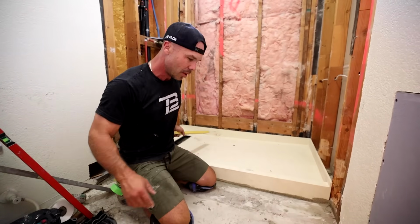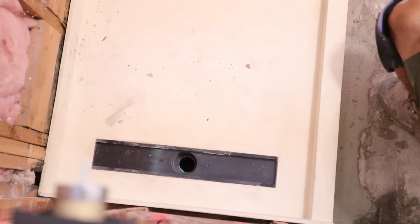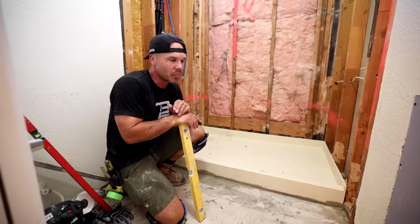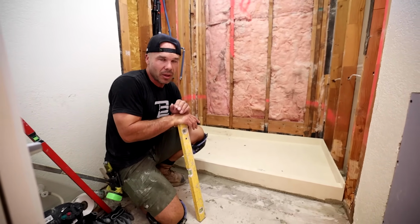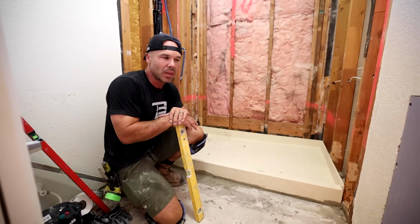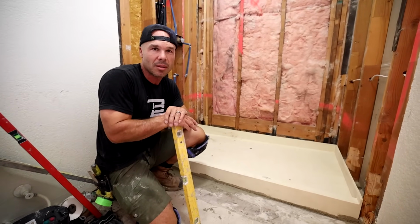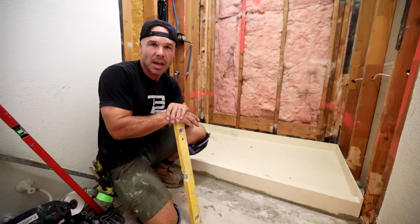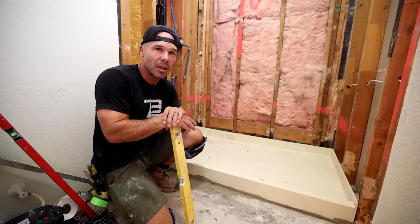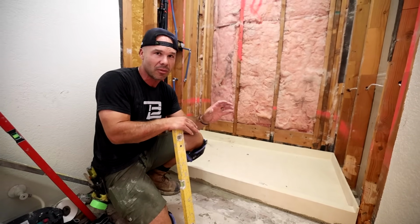You've also seen in a lot of my videos I've talked about the linear drain dilemma that we have. We've done a lot of Schluter Kerdi line drains, and with all the rash of failures that are happening with the fleece delaminating from the stainless steel, I haven't been able to do a line drain system confidently. And I've had customers ask me about them. I say, look, these are failing. If you want to put one in, we can do it, but it's not on me. I warned you that the manufacturer has failures.